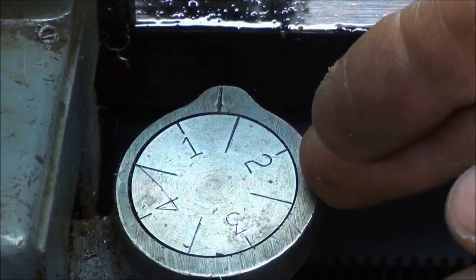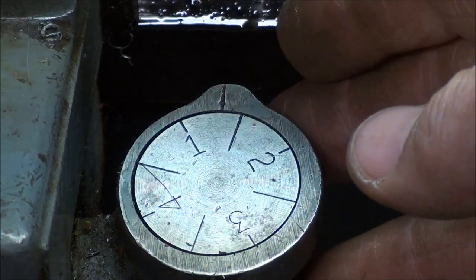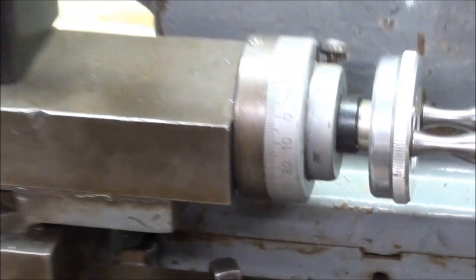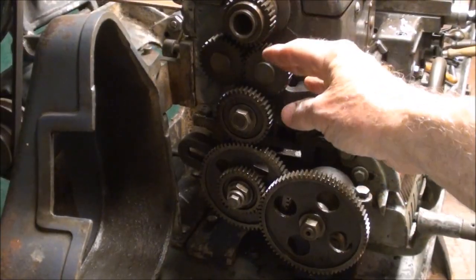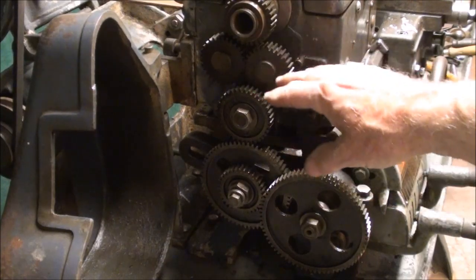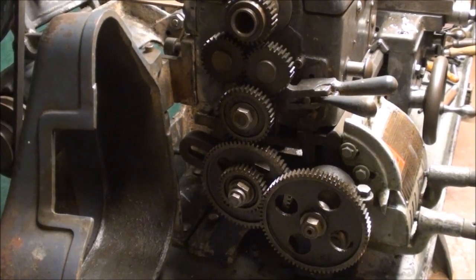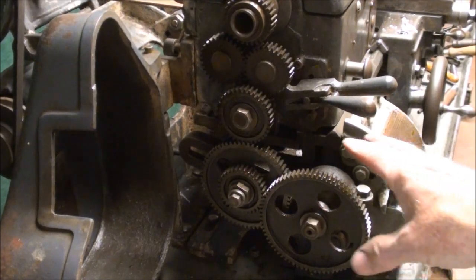Some would say to just catch it on opposite numbers, but that isn't really going to work reliably — it might work with an odd number of threads, but you'd need to experiment. I'm going to continue the way I did and move the compound in 84 thousandths. On a Logan or South Bend lathe, there is some gearing — the stud gears — that can be changed to give you that 180 degrees, but look that up and study it first. That cannot be done on the Clausing lathe or any gear-headed lathe, as the gears are not conducive to it.